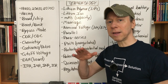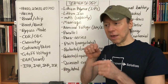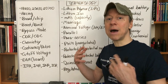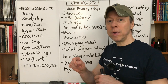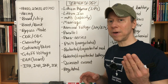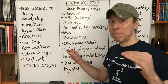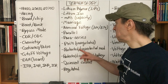PWM stands for Pulse Width Modulation. It's a way of turning the voltage on and off quickly, and by varying the width of the pulse — how we modulate the current — you can change the power. Small, infrequent pulses mean little power on average to the coil; long pulses with short gaps between them mean much more power on average. By dialing that up and down from zero to 100, you adjust the average voltage to the coil.